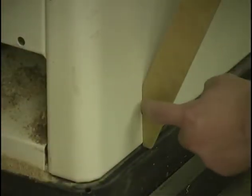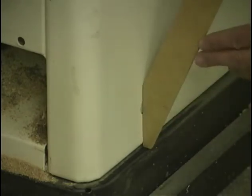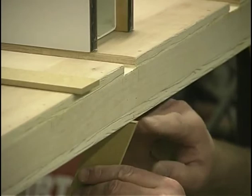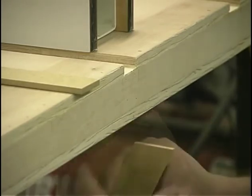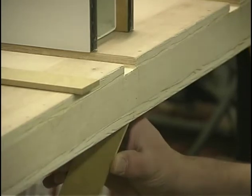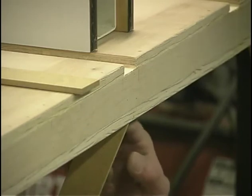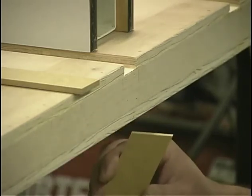Now I can go over to the bandsaw and cut away this waste material. Now with the brace in place, we can see that we still got a little bit of gap up near the top end of this angle. However, in my case, that worked out real well because up here at the top, you'll see that I need to go in a little bit further. So if I just cut it off a little bit shorter, it should fit up perfect. And we'll see how that fits up. Not bad at all. We're going back about a 1/16 of an inch. We're good and tight and flush along the back edge near the bottom, and we're flush along the undersurface of our table. Now we've got our template and we can make our braces out of the oak.